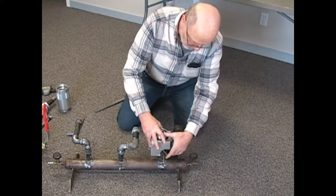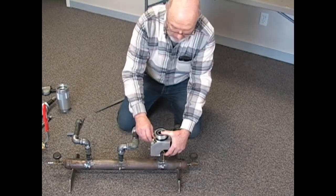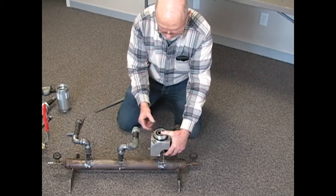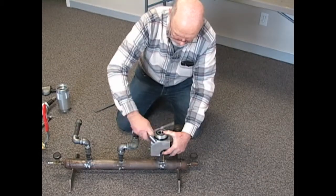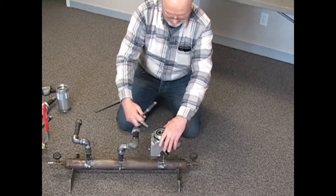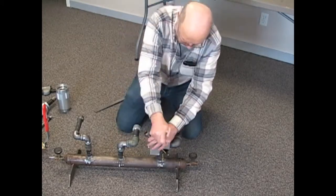Make sure the housing position is straight and the recessed area inside the housing matches the raised areas of the elbow. Secure the elbow housing by fully tightening the elbow housing nuts equally and alternately using the 9/16 socket until noticeable resistance is felt. Do not completely tighten one nut before tightening the other. There is a rear adjustment screw that can be tightened or loosened to adjust the housing's vertical position, though most of the time the screw adjustment is not necessary.